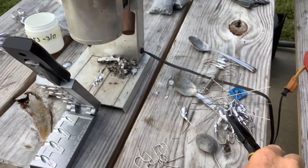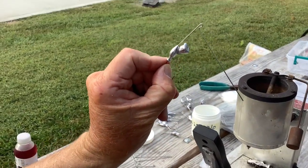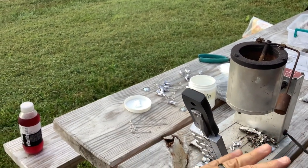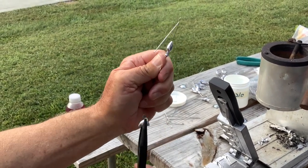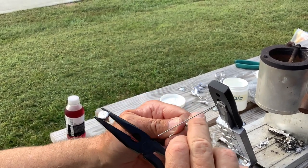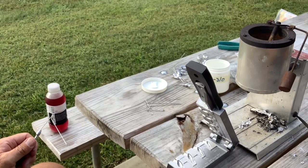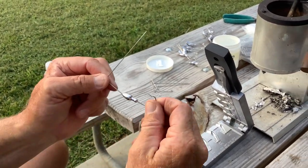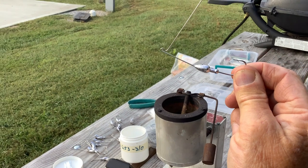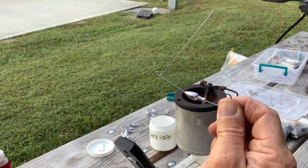That's just one part of it. I've got a pile here — they're still hot. Make sure you let these things cool off before you touch them. I'm gonna take one and bend that and break off the sprue. You can take some side cutters and cut that, but I seem to get a smoother edge by bending it off. I'll take my needle nose pliers and recycle that little piece of lead. We've poured our spinnerbait frames — I'm going to continue pouring, then we'll get our powder paint out and show you the next step.